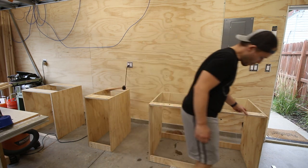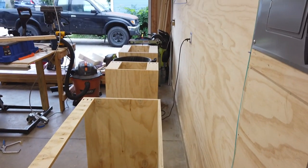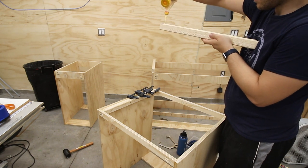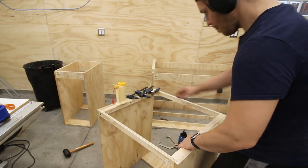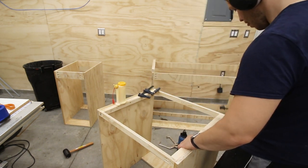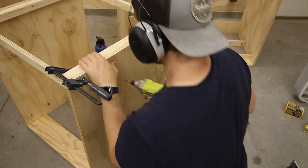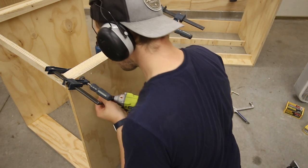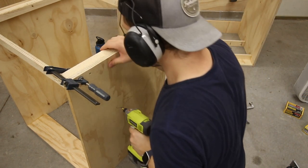This would come in handy later, as I discovered that our large, bulky, 26-foot collapsible ladder could fit behind the cabinets, thus giving it a permanent home for the first time since we bought it two years ago. Before permanently placing the cabinets, there were a few other tasks I needed to do, one of which was gluing in a 2x2 on the bottom of each one to receive the T-nuts that would hold the carriage bolt feet. Once this was glued in, I secured it with half a dozen screws — potentially overkill — but considering this is in joint effort with the 2x2 that I later attached to the wall, the primary means of support for all the weight the station will hold, I wanted to make sure there was enough holding power.